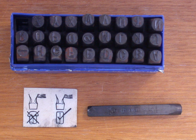A transfer punch is a punch of a specific outer diameter that is non-tapered and extends the entire length of the punch. It is used to tightly fit the tolerances of an existing hole and, when struck, precisely transfer the center of that hole to another surface.